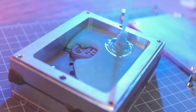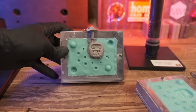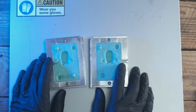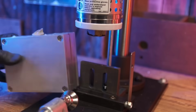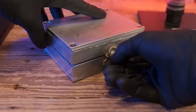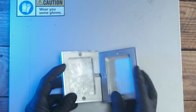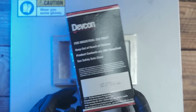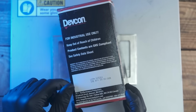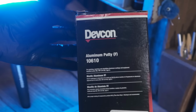I made one with silicone. Now silicone does hold up to the heat. The issue is it's flexible. And I have found that you can get your thermoplastic to squirt in there and then the thermoplastic comes right back up out of there. You could just take a mold frame right there and use some heat resistant putty. Look at that. Alright, that will give you a rigid mold.